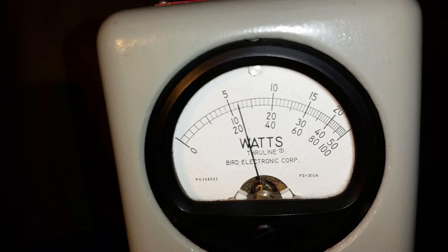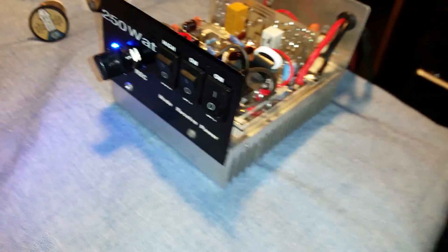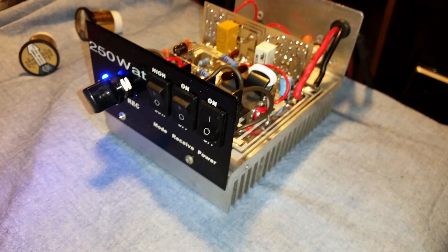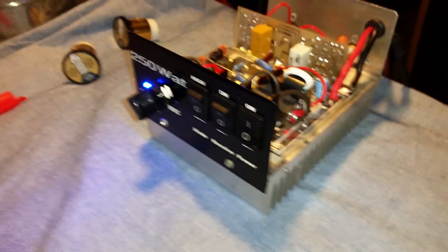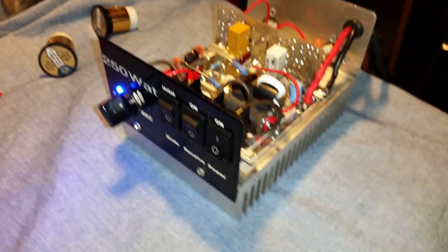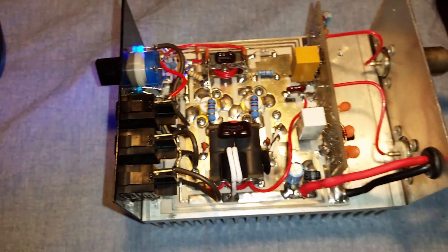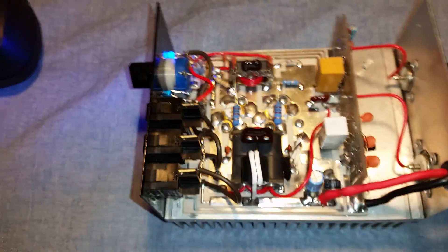Here's PEP — about 250 watts peak. She is working good, man. That's good for a 1446 box. If you can get two 1446s doing about 250 up to about 300, they're doing good. With 100 watts RMS out of two of these bad boys — beautiful. That was 8 watts RMS peaking around 30, 35 watts hitting in on home. Nice clean 1446, Class C amplifier, all repaired up, cleaned up to the brim. Off the eBay it goes. Gatekeeper said it and we're good and we're gone.